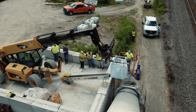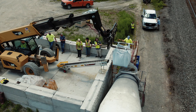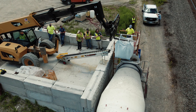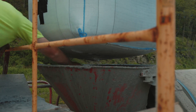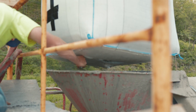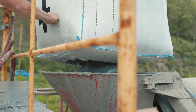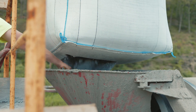Once loaded with sand, the truck then backs into position at the loading platform and one cubic yard super sacks of dry CoreTUF powder are positioned over top of the ReadyMix truck and cut open. We are performing this action by hand in this example because we did not want to interfere with the regular daily production of the facility and an additional material silo was unavailable at the plant. If a silo were available, this portion of the batching process would have been performed through automated plant controls in the same fashion as the cement which directly follows it.